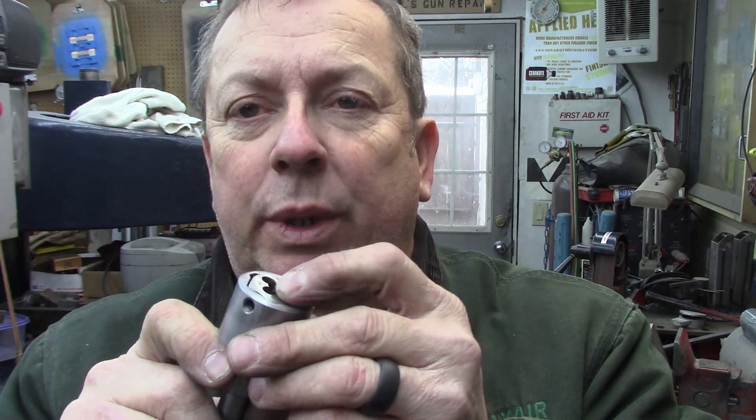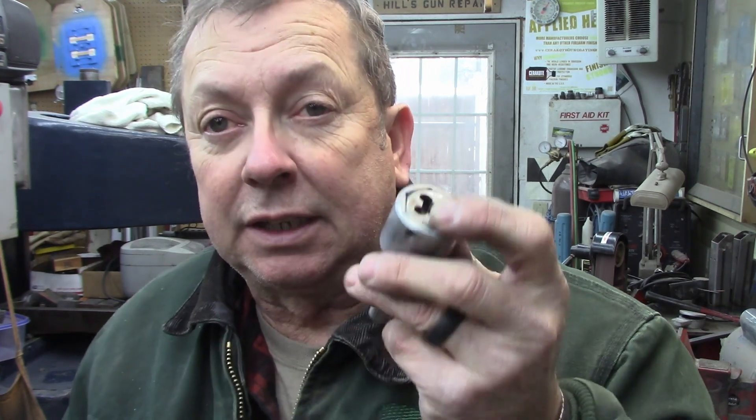This is our upper portion — this is the hex we turned in there, and it's going to accept a die just like that. I'll put probably two set screws in — I've got three set screw holes around the side. Two will be actual set screws, and one will get a button head cap screw with a piece of hose on it like I had on the other one, to use as a handle when I start to back it off. Now, design considerations: I could have set this up for a round die, but I intentionally set it up for a hex.